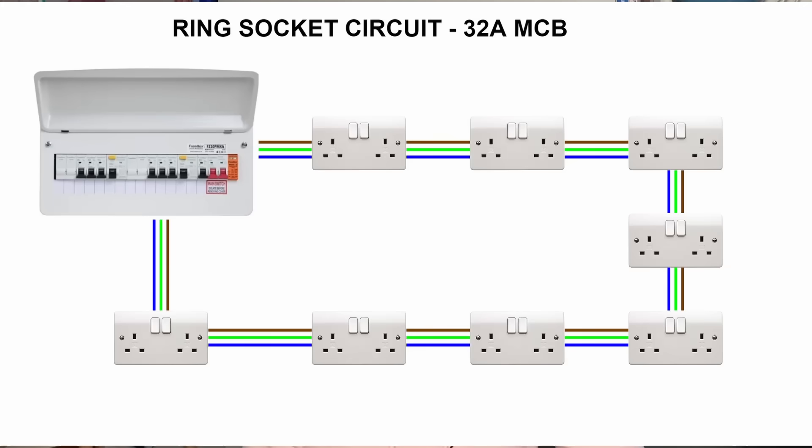This is one of the reasons why electricians must do what's called a ring continuity test on any rings they work on, in order to ensure they have a complete ring with no loose or broken connections. Personally I think the ring circuit should be removed from the regulations, as if a break were to occur it's possible for cables to become overloaded without the homeowner knowing. Fortunately, rings have started to fall out of favour more recently, with electricians tending to opt for radials rather than rings.